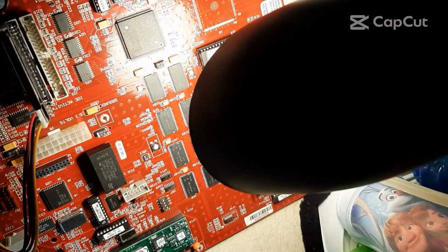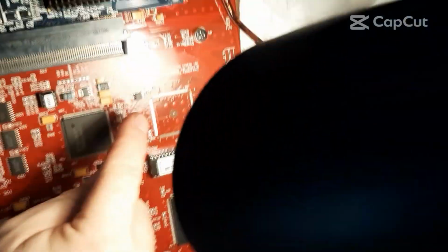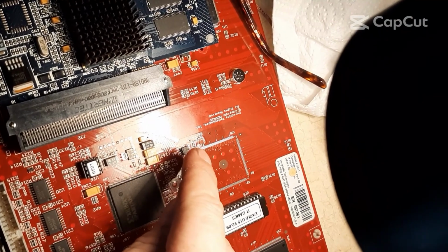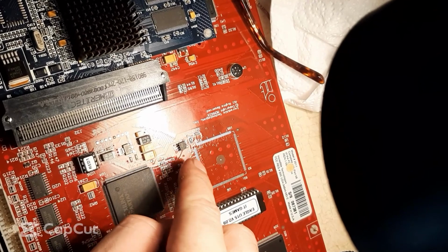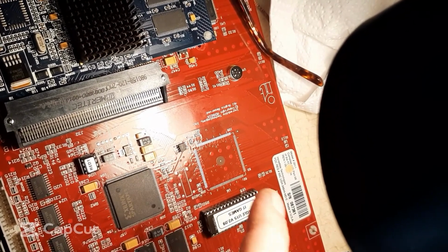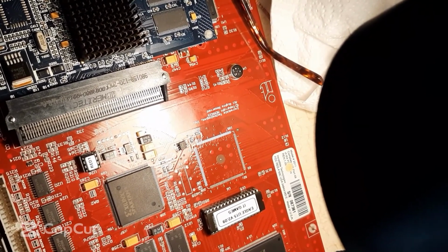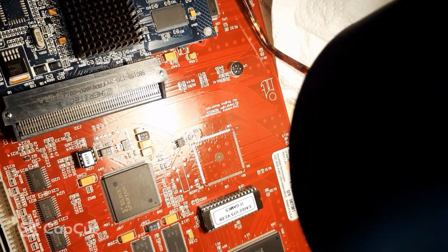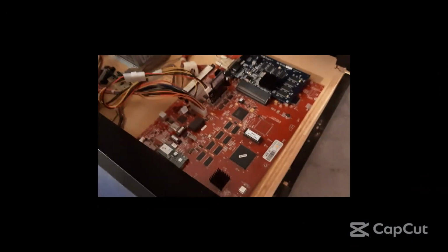All good. All good. And I checked U61 with a loop, I don't know what it was, 20 times. It is crooked, but there is no solder bridging, and each leg is on each pad. I mean, the soldering kind of looks like crap, but it is connected, so I'm gonna count it as connected. I guess we're gonna find out in a minute. Okay, got the board in.